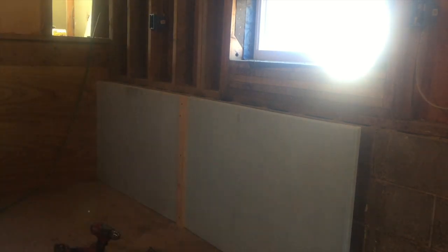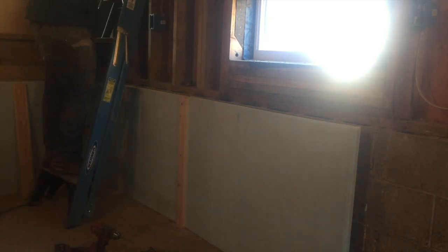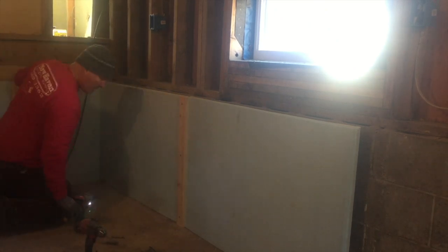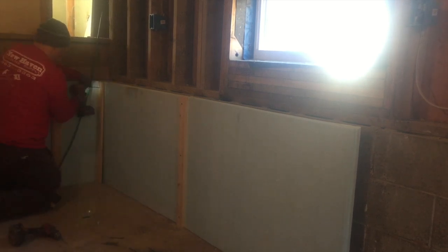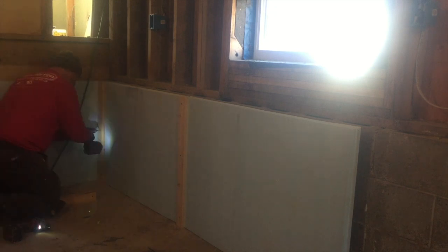So here we're just putting the 2-inch polystyrene on there, and we got some 3/4 by 3 furring strips, and we're tap conning these strips in. I use 3 3/4 inch, 5/16 tap cons, so you need some long ones to hook these in. So all these are going to do is hold the foam until we can get it all secured, and then we're going to actually hook the tubing to these strips, which I'll show you in a little bit in the video how we did the tubing. But that's all we're doing here, just drilling them out, tap conning them in there.